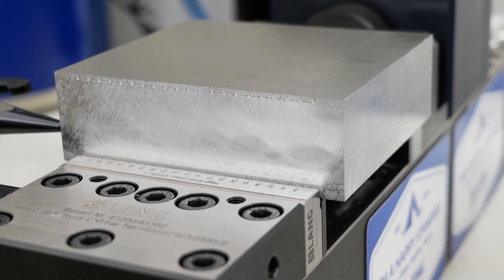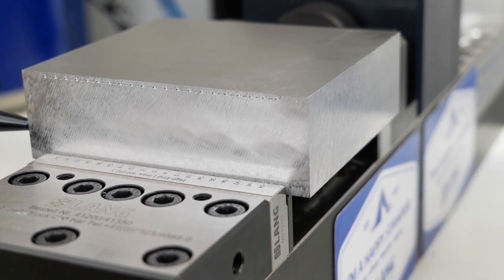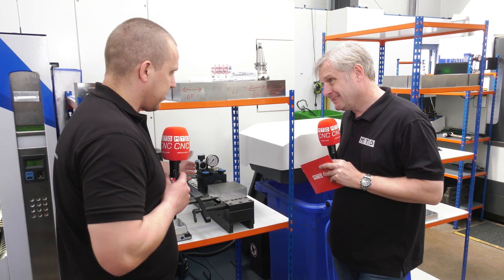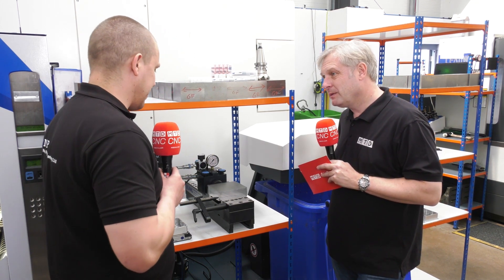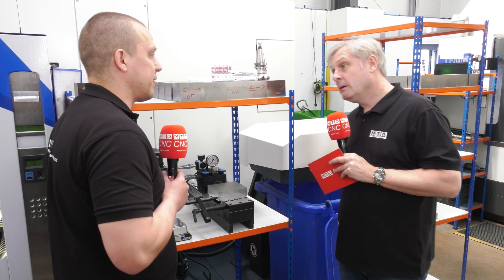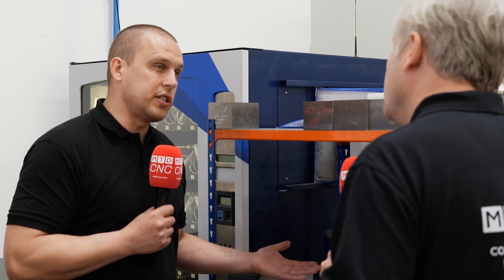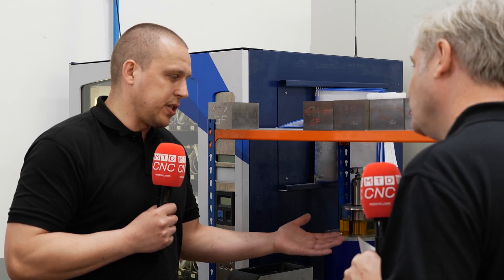You say always — two things. What depth is that? That's 3mm. So we are holding our parts on 3mm for various reasons, most of them saving time and money for our customers. How's it saving time? Less machining on the other side — unless we do 5-axis, it's still less machining — and then saving us money on material.